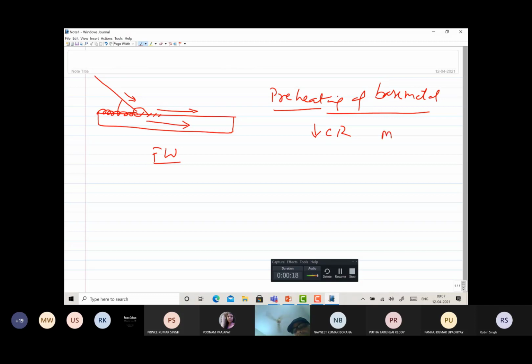There are medium or high carbon steels, and many hardenable steels, many cast irons. All these are very crack sensitive when subjected to welding. So during the forward welding of such hardenable steels, the preheating of the base metal is realized during the welding itself, automatically, without use of an external source of heat for preheating. That in turn reduces the cracking tendency.